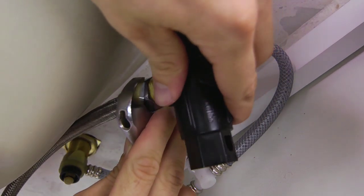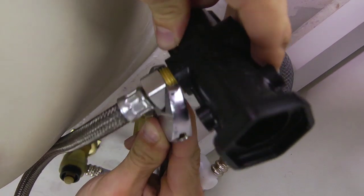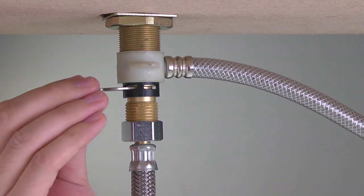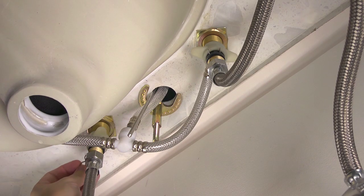Now you're ready to connect the existing water lines to both of the valve bodies. While holding the nut of the water supply line with an adjustable wrench, use the quick install tool to screw in the inlet line adapters for your hot and cold water supply lines. The hot water supply always connects to the left inlet and the cold water supply lines connect to the right inlet. Once you have the inlet line adapters attached, connect each one to its correct side of the sink by using the connector clips that you insert through the windows on the valve stem. Push the clip tightly through to the other side — do this for both lines.